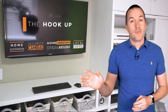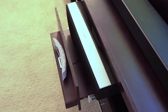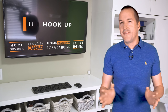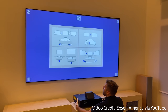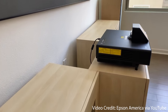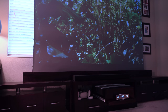Next was the projector, and an ultra short throw projector was definitely the way to go since I wanted a completely out-of-the-way setup with no ceiling mounts or visible cables. However, something that most people don't seem to be talking about is that even though ultra short throw projectors can make a large screen from a short distance, it's not an infinitely short distance. In the official installation video for the Epson LS500, they needed to pull the entertainment console over 16 inches off the wall just for a 100-inch screen — so it would need to be even further for a 120-inch screen. With my floor-rising screen sitting about 6.5 inches away from the wall, my projector would be sitting about 2 feet off the wall, which definitely wasn't going to work for me, so a motorized shelf seemed like an obvious solution.